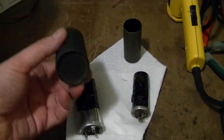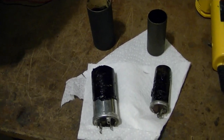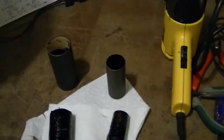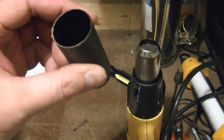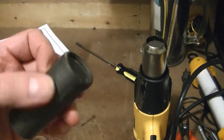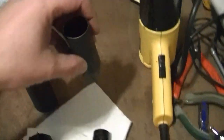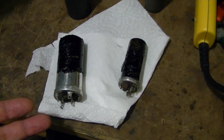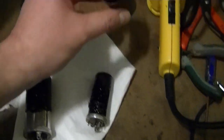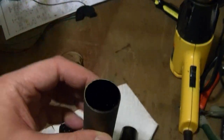After I unmounted those two cardboard-insulated electrolytics, I actually put them in the oven for a while at about 300 degrees until the tar got soft, and I managed to pull the covers off. In the past I've used a heat gun, but the problem is you're roasting the cardboard which is acting as an insulator, and it's not doing a very good job of getting the tar inside hot. Often I end up charring the cardboard by the time I get the tar loosened up. So I just put these in the oven, which heats the whole thing up from all sides evenly. And I'm able to get it out without too much trouble - this one especially had a whole lot of tar, and I think if I just used a heat gun I would have had a very difficult time getting it off.